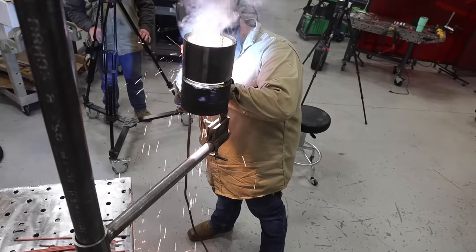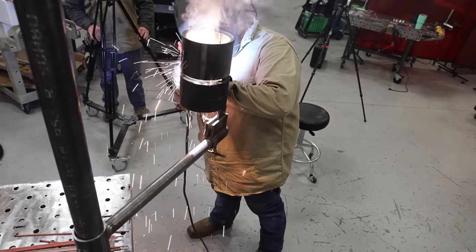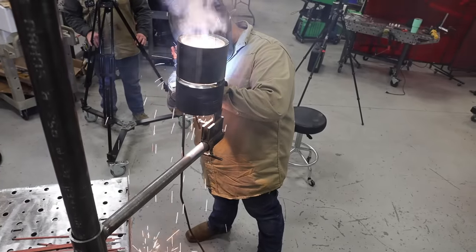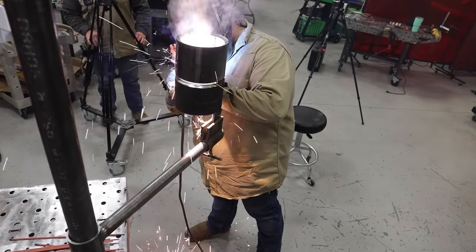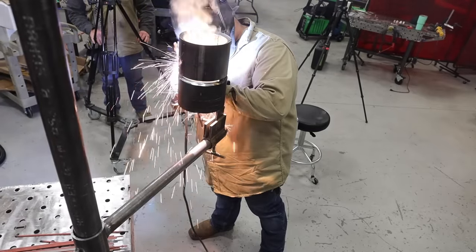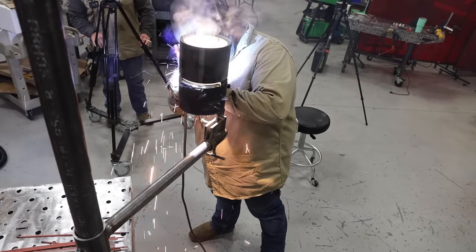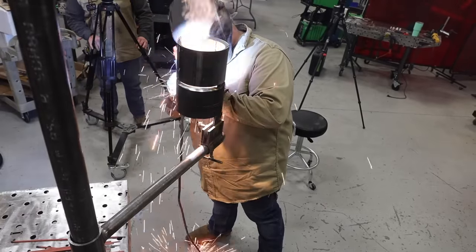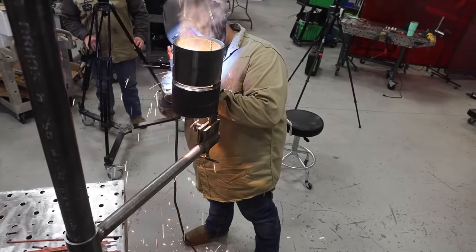Especially when you're new, you want to standardize your fit as much as possible. You want repeatability. When you slam these two pipes together, you want to know your gap, your land, and try to mitigate your high-low as best as possible. So pipe alignment, when we talk about high-low, is internal pipe alignment.